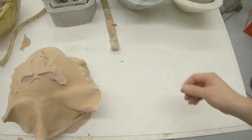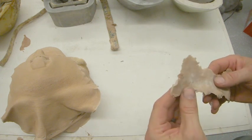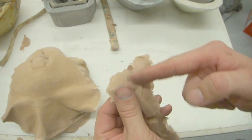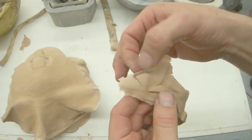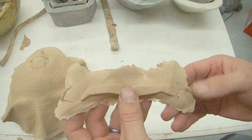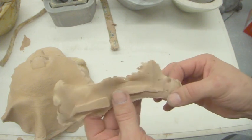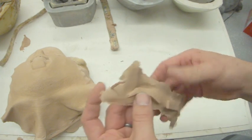All right, so let's have a look at some pieces that have issues with them and why. If you look at this piece here, you'll be able to see that there's like this hard sort of bits of rubber through. That is what happens when you don't mix your gelling agent thoroughly enough. Remember we were talking about a section sometimes on the bottom that'll gel into like a goober and then go through. Well, that's kind of what happens. It makes a very hard rubber kind of piece and messes up the piece.